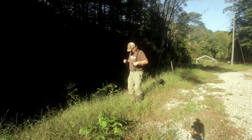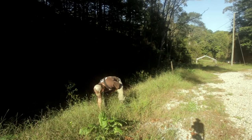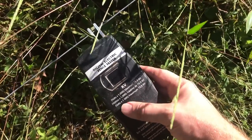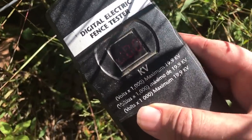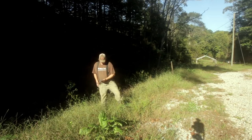I'm going to test the fence quickly to see what I'm getting, with as much grass as there is on it all across the pasture. We're getting 1.97 — so that's almost 2 kilovolts — which in my experience isn't enough to keep a pig back.